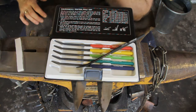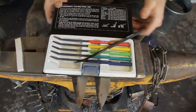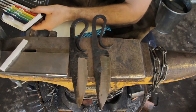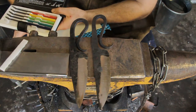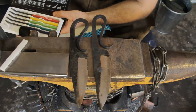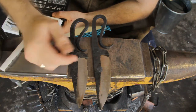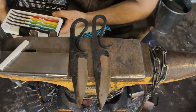When it comes to testing knives, the most important thing is to have a nice clean surface that you can scratch. Putting a scratch into the hardened scale that your blade will be covered in before you do any cleaning up — that's not going to give you an accurate result. It's basically going to give you a misleading idea of what's going on in that steel. Scale tends to be very hard, so if it's thick enough, the file might skate off. Or if you've taken the scale off, you could still be working on the decarburized part of the steel on the outside.